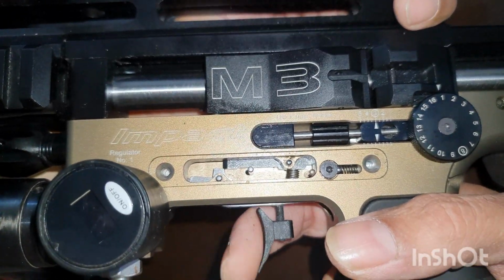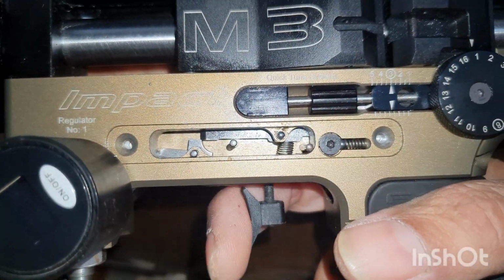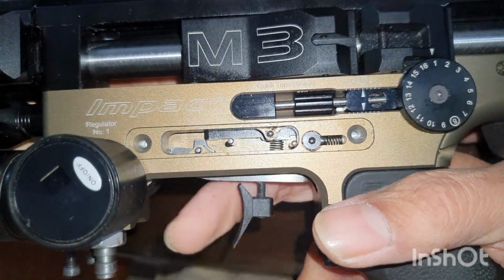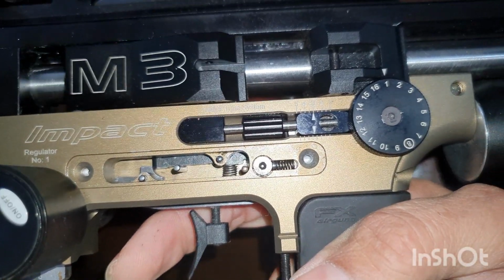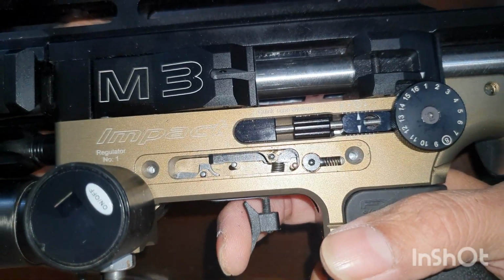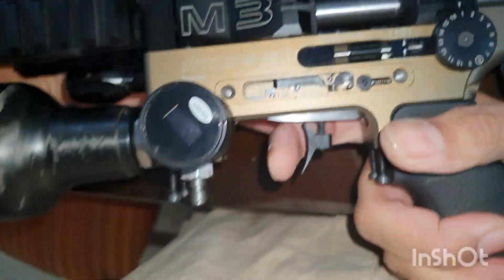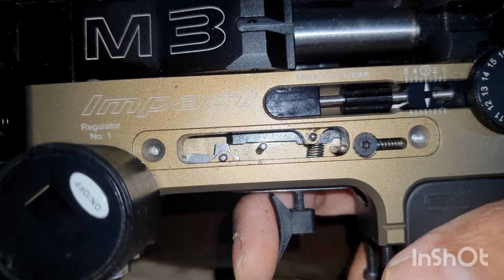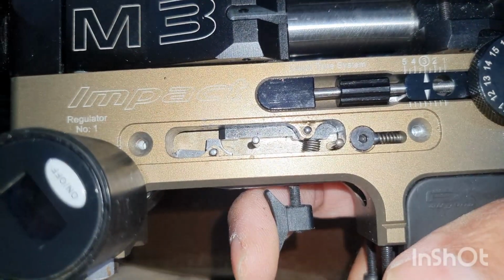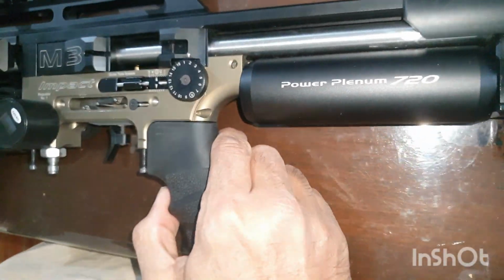You can see that the sear that I have made is not moving in the first stage, and the gun is working fine. I make it dry fire, right? You see the movement during the dry fire. First stage, this, okay? See again, please make it close, yes. See, this first stage, this, okay? So this is the whole project to where I have reached.